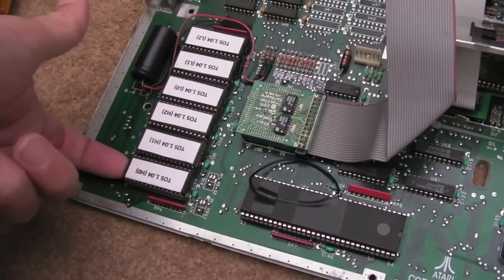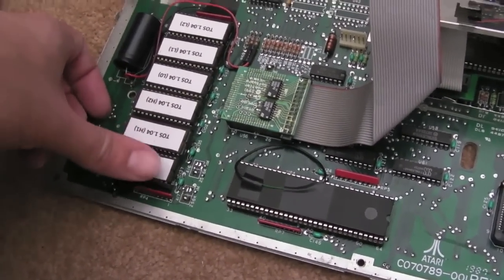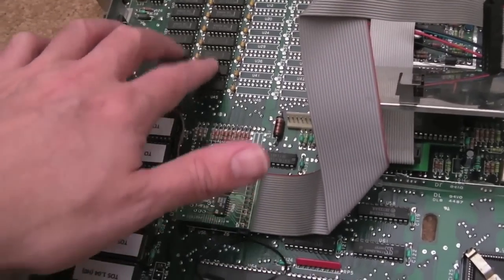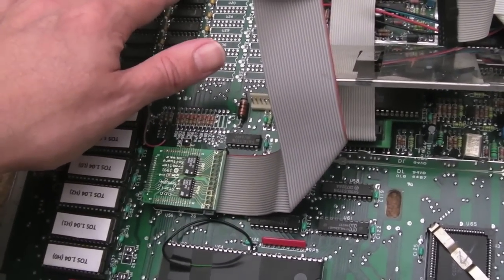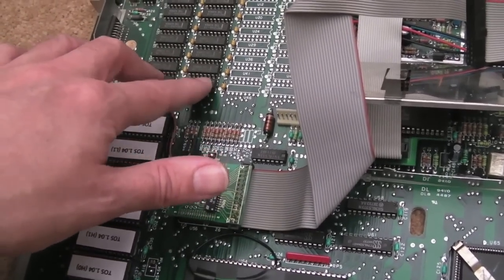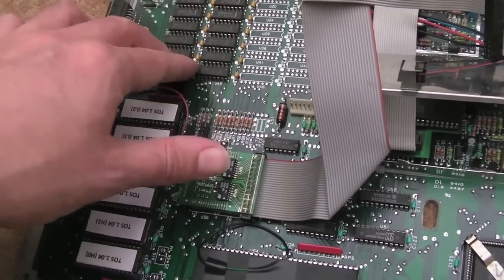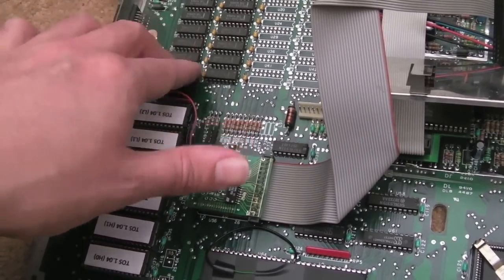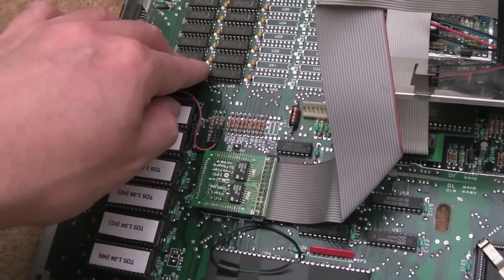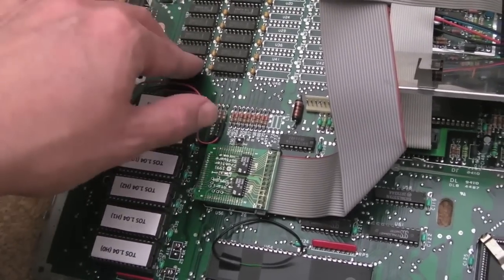For pressing down DIP chips that doesn't work, you could actually lever them out gradually with a screwdriver and then push them back in. You've got to make sure you don't bend the pins and get the chip the right way around. Other than that, you're probably looking at faulty RAM. You could try the piggyback approach, as I mentioned in my ST teardown video - get one of these RAM chips and piggyback it on there. As long as it's making a good physical connection, if that works and your problem's gone, you've probably found the faulty chip. So you could desolder that, put a socket on there, stick a new one in.